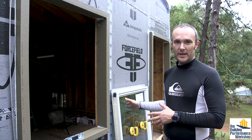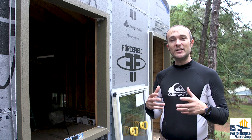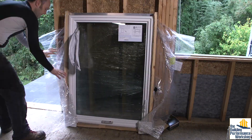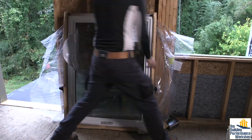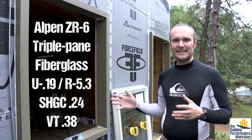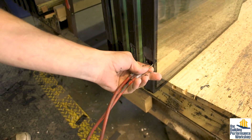These are Alpen windows, made in Colorado. When we received them, the first thing you need to do is unwrap the plastic. There is a bladder on this — a reservoir for the gas that's filling these windows. These are triple pane, Zenith series, ZR6 is the series number. The triple pane has the middle pane being just a film of mylar, and they're filled with argon.